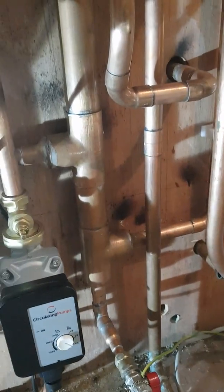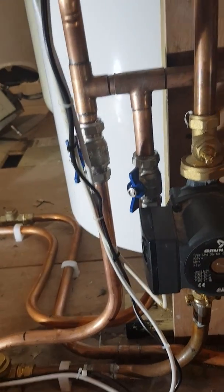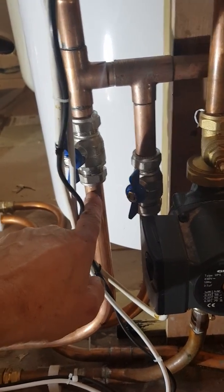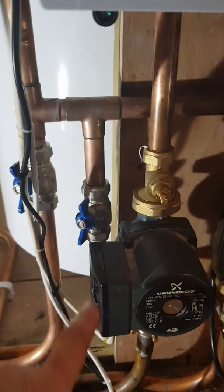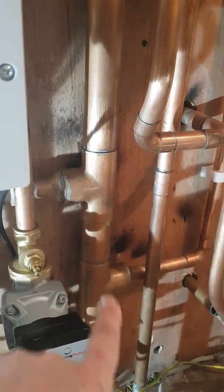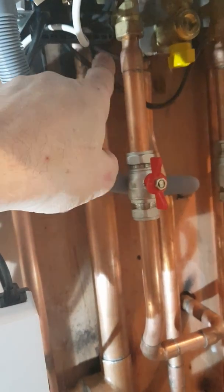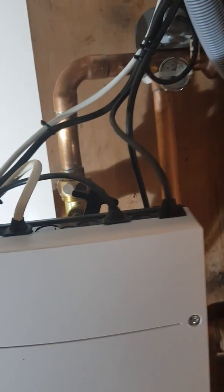You can see my return path going back to the boiler there from the base of the header. Then I've got my collection manifold there going off to collect the returns from the two circuits. This has to be the return from the underfloor heating because it connects into the cold side of the three-port mixing valve. This one here being the return from the radiator circuit, coming back into my manifold and going off this way. Flow straight out of the boiler — I've kicked that over inside at 45, put a 45 on there to drop it straight into the top of the header.